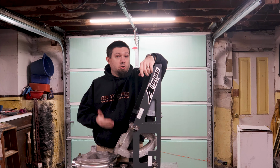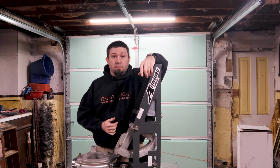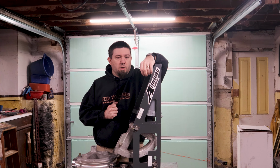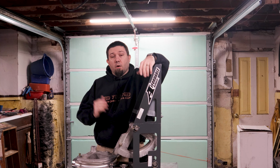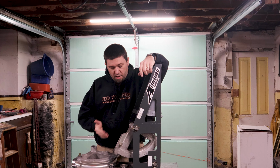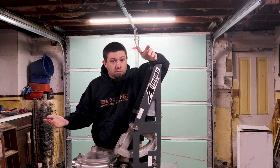Can you build things like tube fenders and rock rails and whatnot with this? Absolutely. I think those are a perfect use for this bender. Because, sure, you can't use .120 wall, which means you're going to have a slightly thinner wall tube, which means it could bend and dent on the trail a little easier than .120 wall, which is a very common thing for people to build these things out of. But you've got a bender at home. You can build new ones.